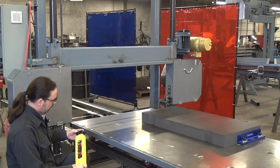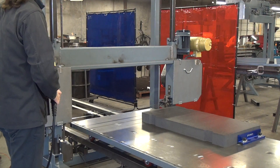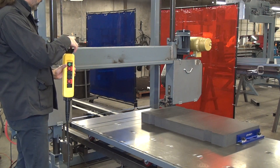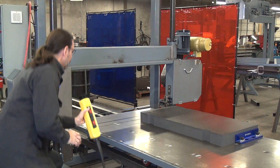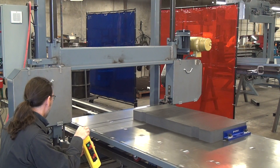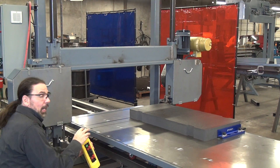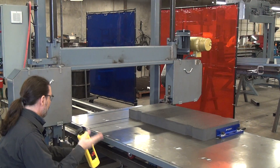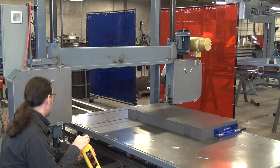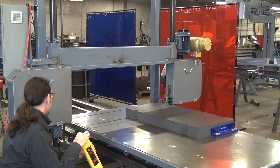I'll set my table speed to zero, start the blade drive, and stay kind of clear of the machine when doing this. Now that the blade is running I don't have to hold the forward button. I'm going to do this very slowly to start — once you know what you're doing with this material, machine and everything, you're going to speed this up quite a bit. Feeding in — no trouble at all. I'll increase my speed a bit.